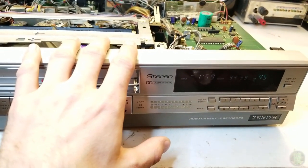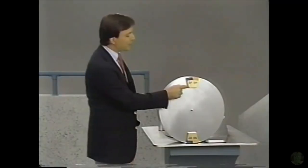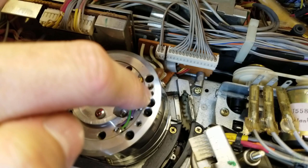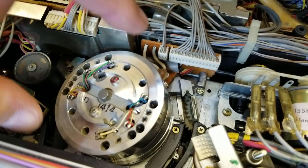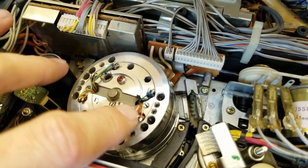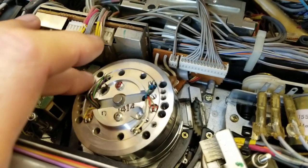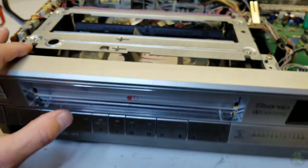It has linear stereo and hi-fi stereo. It's a four-head double azimuth, which surprised me for a machine so old. Check this out. See, the video heads are together side by side, and that is what they call double azimuth. I can't remember what angle they are from each other. The idea is that these fields work opposite. So you have EP heads and then SP heads, and this one will catch what the other one doesn't. It's basically cleaner special effects is what it gives.